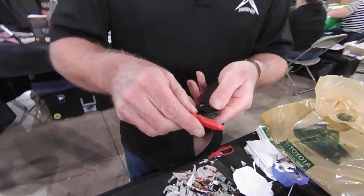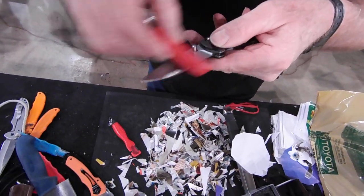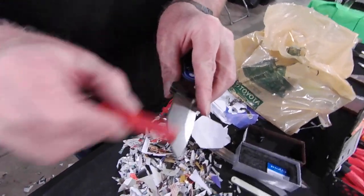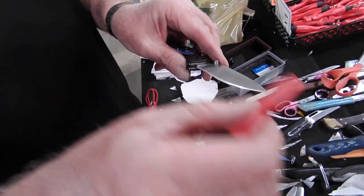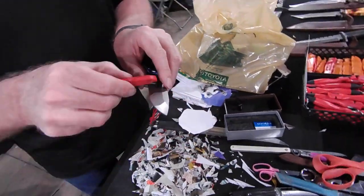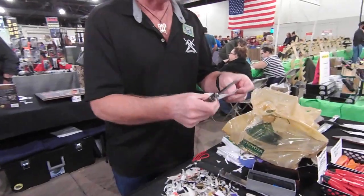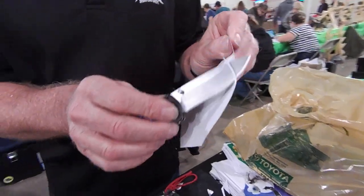Match the bevel that the factory put on it — 12 to 14 degrees. Turn it a little bit, begin to brush the blade, move right on out towards the tip, around the radius, and right off the tip like that. Turn it over, you can come back this way, out that way. Just keep moving the sharpener. Gentle — don't push too hard, let it work, don't make it work. In that very short time, let's see if I made a noticeable difference. That's sharp.